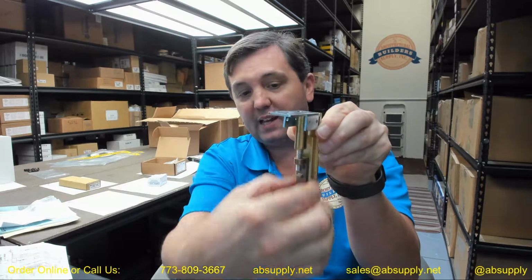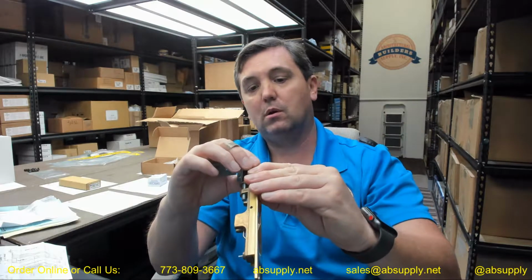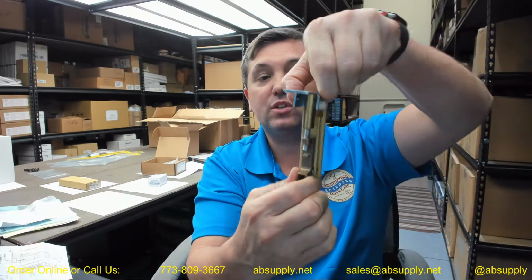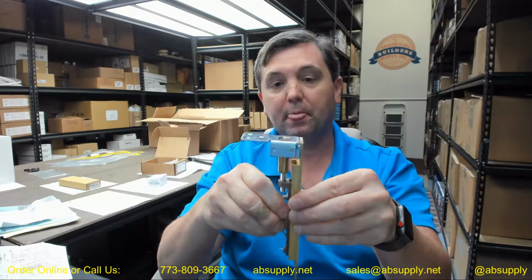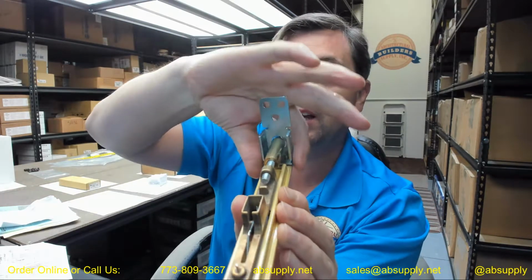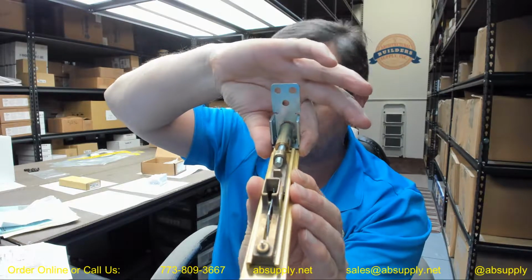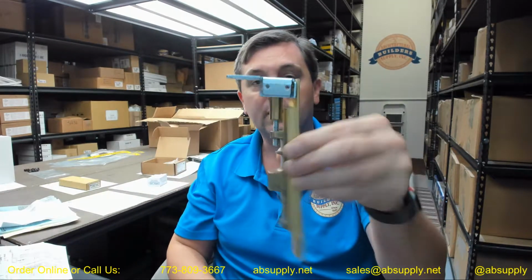Basically, you would do a preparation in the edge of the door to accommodate the body here to a specific depth. Okay, you probably might route. I would do a preparation that would be only so deep underneath the faceplate so that this could rest underneath or on top of the door. I would then mortise wider to accommodate the top plate, because that's getting basically the same thickness as this 3/4 inch wide, 1 inch wide faceplate, forgive me. And then I would come back to the depth necessary for all of that.